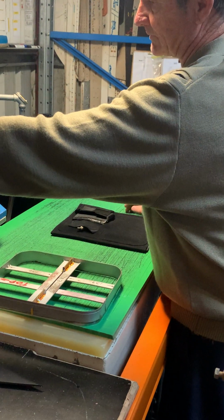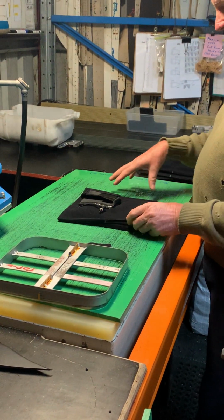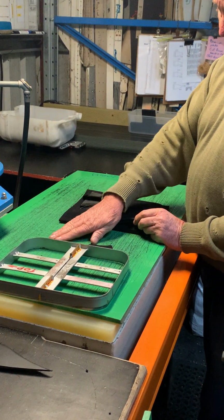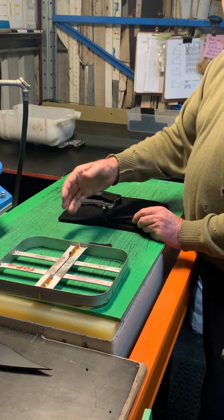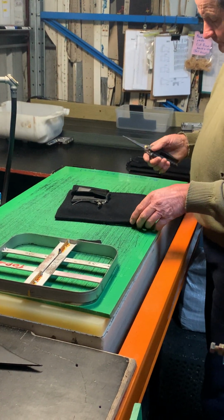Like the pressure gauge up the top here, you dial that in and out depending on what you're cutting. How you gauge it is by how your knife die goes into your cutting board. If it goes in too deep, it's too much pressure. If it doesn't cut right through, not enough, more pressure is required. All right, and then we'll obviously just trim up the edges.